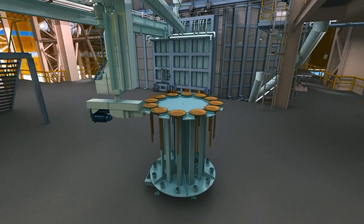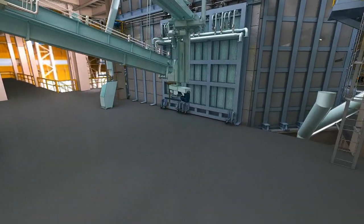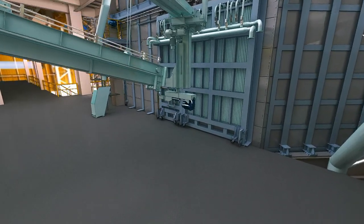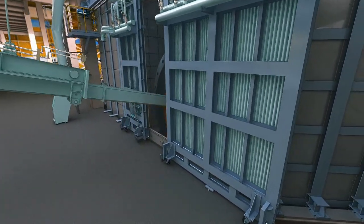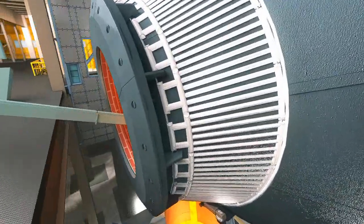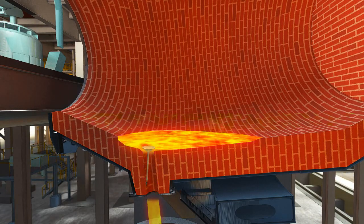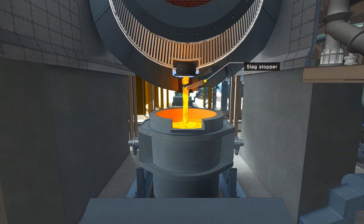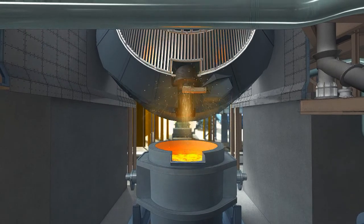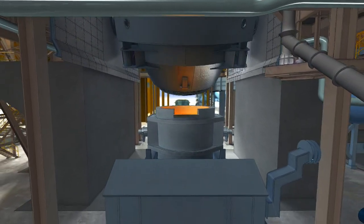A dart is selected from the dart storage and mounted to the arm before tapping. When four-fifths of the ladle is filled with steel, the dart will be injected into the converter vessel. After all the steel is tapped, due to the difference in specific gravity of steel and slag, the dart will stop the slag from flowing out through the tapping hole. The slag stopper installed at the trunnion ring then operates, and N2 is sprayed from the nozzles into the tapping mouth to cut the slag.